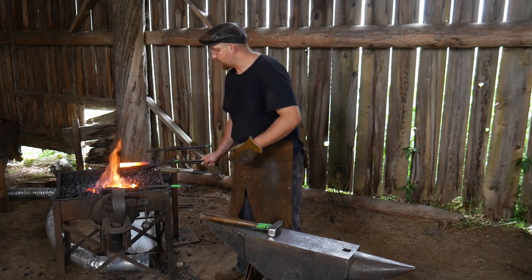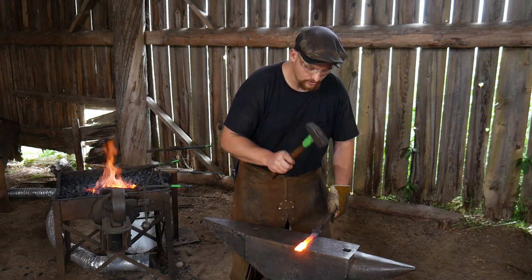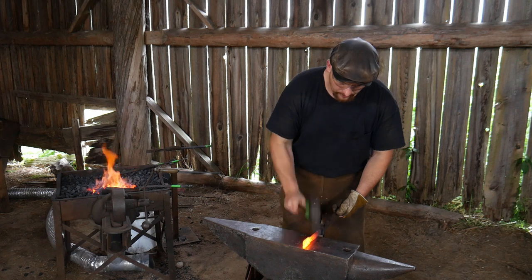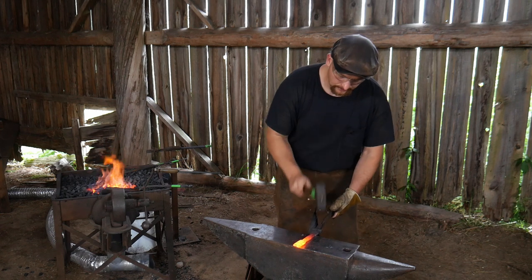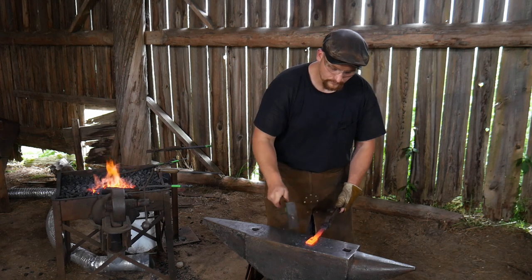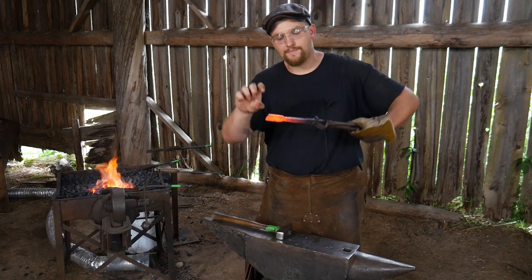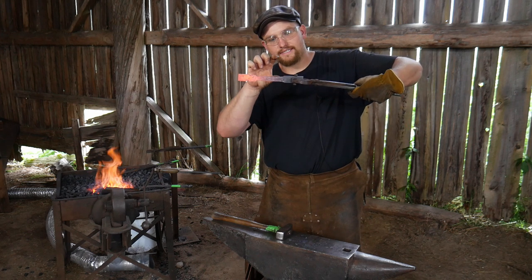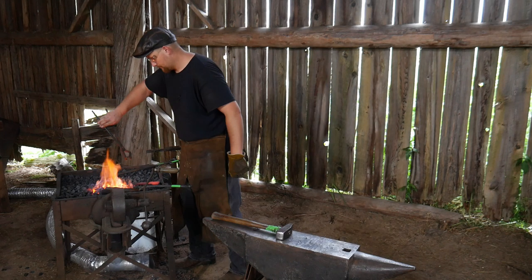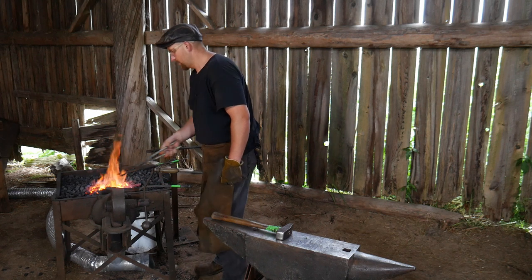During this process you may also want to flip the piece end-for-end to avoid getting too long a taper going one way, so you can work your near side better. The challenge is to draw this out as long as you can while keeping it even in thickness — this end should be exactly the same thickness as the other end, and it should be the original parent bar thickness across the top. So we're going to flip it end-for-end to focalize blows on the other end.